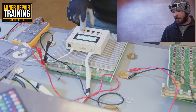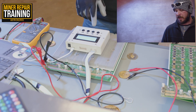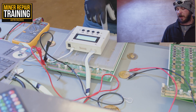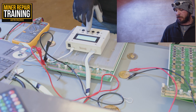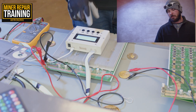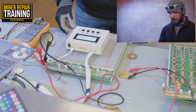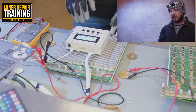Now we can turn off the test. Press B4 to go back to the main menu. You can also test the temperature sensor, and you can also repair EEPROM — so this can read and write EEPROMs as well. We'll go ahead and test the temperature sensors and then start it. As you can see, we can see all the different temp sensors and it shows you exactly their location and what the actual component is.